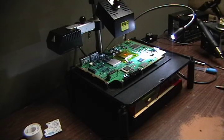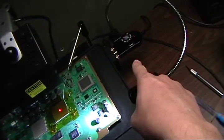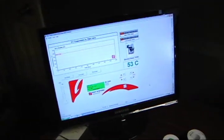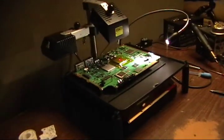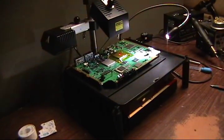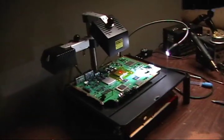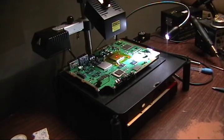Right now I've got the Presto plate heating up. I got the dial turned all the way up to 400 degrees. My temperature is rising. It does get hot enough to get the board up to the 110 degree mark and beyond. Once it hits 70 degrees, I'm going to turn on the upper heater on the fast reflow — I leave the bottom heater completely off now. If you're having trouble with the board wanting to warp because you're doing bigger boards than cell phone boards, you might want to give this a shot because it works.